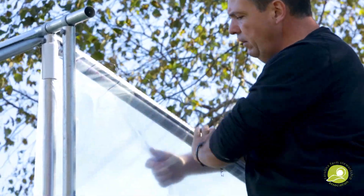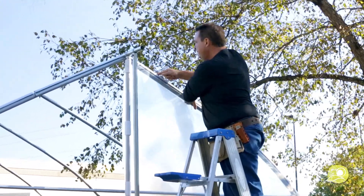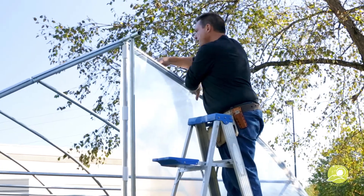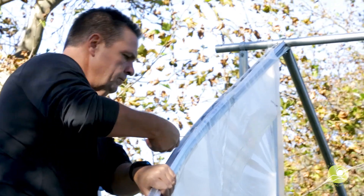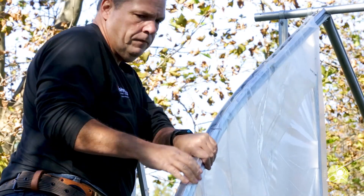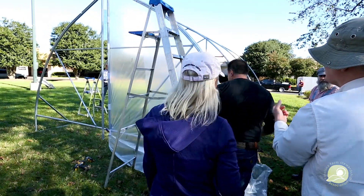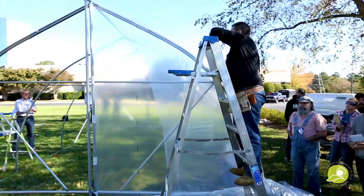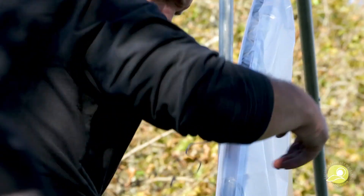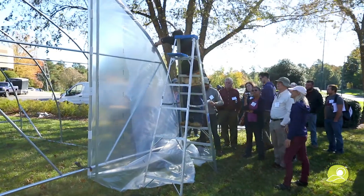I hold this fairly tight, not super tight, because I need to punch through the plastic. I'll try to keep the wrinkles out of it as I go down. The wiggle wire channel gets bent just by screwing it to the aluminum. The channel is aluminum, so we can just basically bend it and tech screw it in, and you can use some vise grips to hold it in place if you're doing it by yourself.